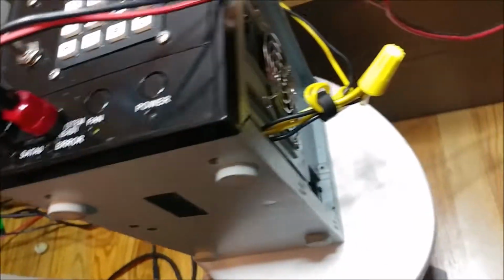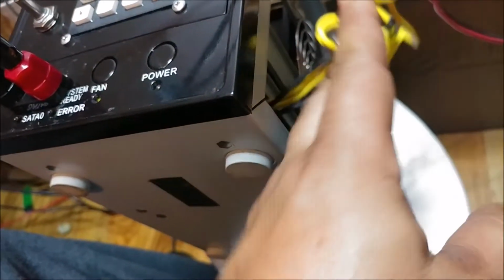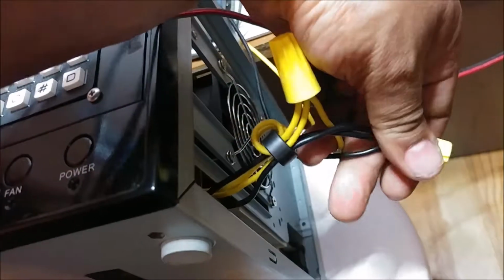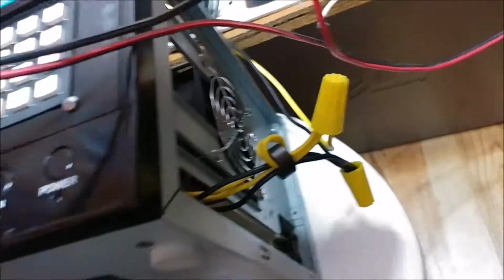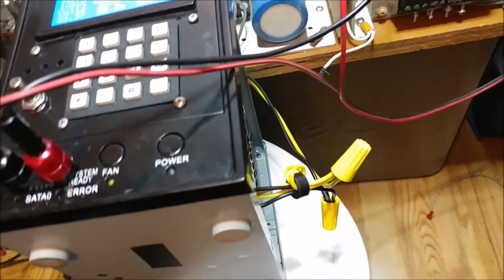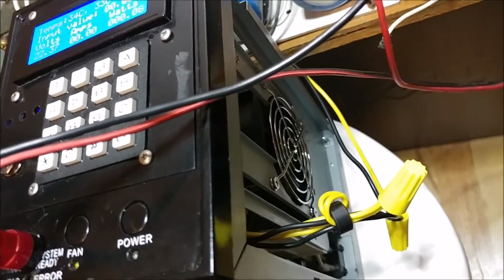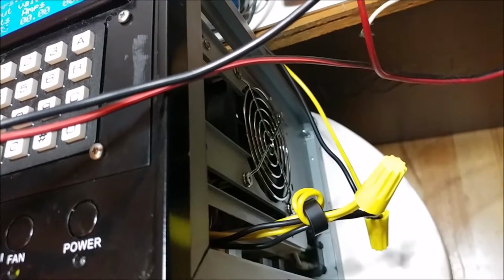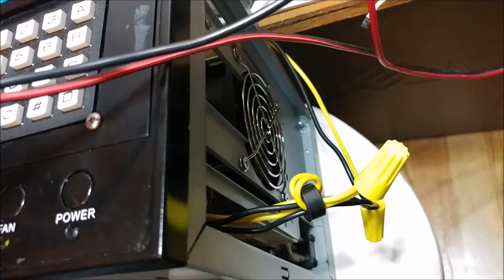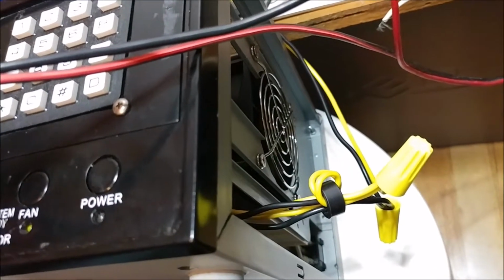So here I have my digital power and my analog power tied in together at this location along with the grounds, but I don't have the fans isolated like this as well. So effectively I'm gonna have to change that on this third revision, or revision 3 should I say, but I don't know, I may end up changing it on revision 4 if I test it and it ends up working as it should.